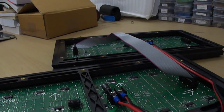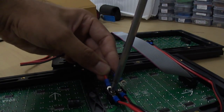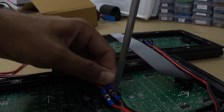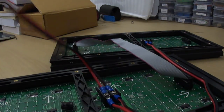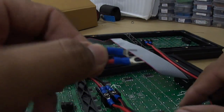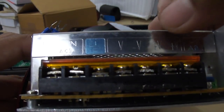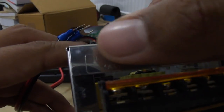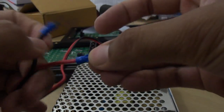To supply the final power to both panels, connect one more connector to the SMPS. This connector goes to the DC power output of the SMPS, which has two V-minus outputs and two V-plus outputs — both essentially plus 5V and ground. The main AC input has live and neutral connectors. The red wire goes to V-plus and the black wire goes to V-minus.